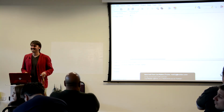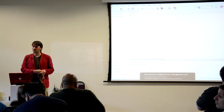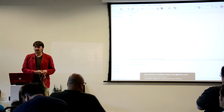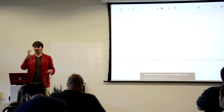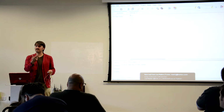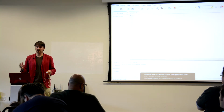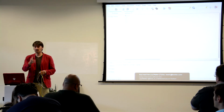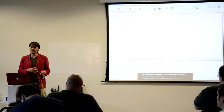Sorry. Has anybody done any work already, or is it worthwhile doing any work, trying to port Arduino onto some of the smaller devices, the Tiny, for instance? That's already been done. So there are cores for that. The Arduino software can have extra modules thrown into key directories, which gives it the information it needs to send code to that type of chip. So that's been done. The reason you don't go down that route is the complexity of managing it. So actually in the context of a school where you're working closely with them, you might be able to drive down the costs there as well.